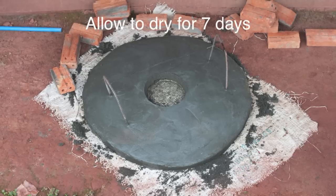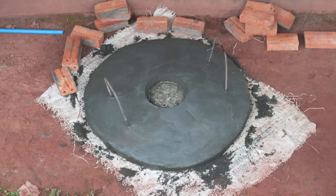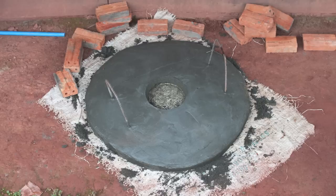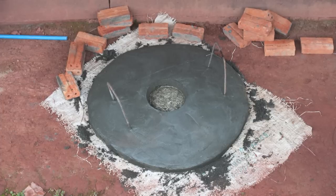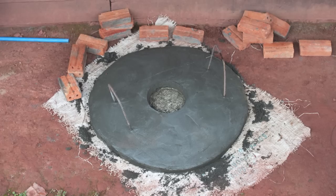I could never make a lid that fit perfectly, so I always need to mix up a little mortar and seal it when I put the lid in place. This seal is easy to break when it's necessary to enter the tank for cleaning. Sealing the lid and putting screen in the intake hole is important to keep trash out and mosquitoes out.